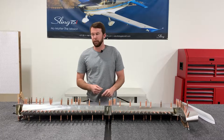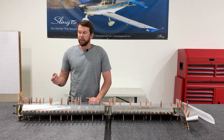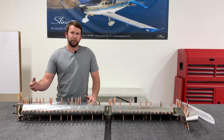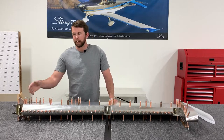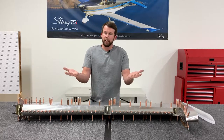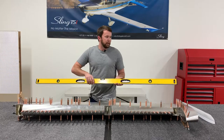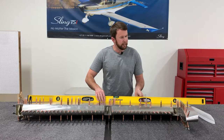Sling does a really good job of bending everything properly. Also note that the rudder control bracket is put on at this stage to ensure you're able to mount it and align all the holes, especially with the angled gusset channel. If there's any misalignment or trouble connecting, the skins can easily be un-Clicoed and removed to get everything to line up. Because the Clicos stick out, the assembly rests up on them, so the control bracket is no longer a factor causing any twist. At this stage, take a long straight edge and double check that your rudder skin is straight with no twisting.